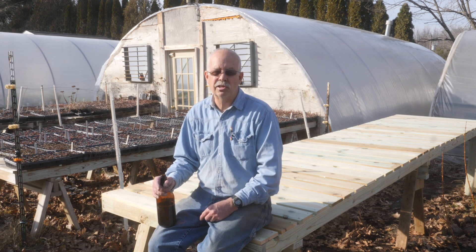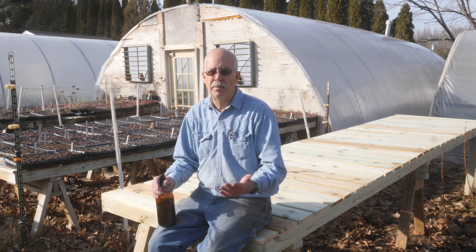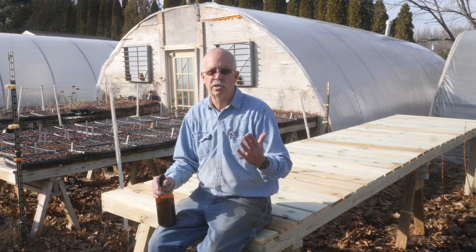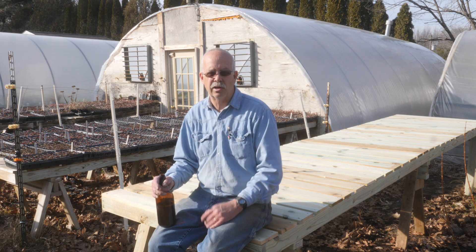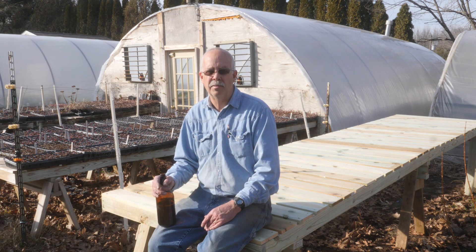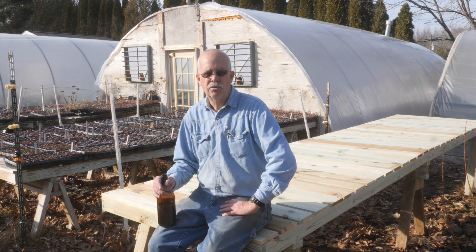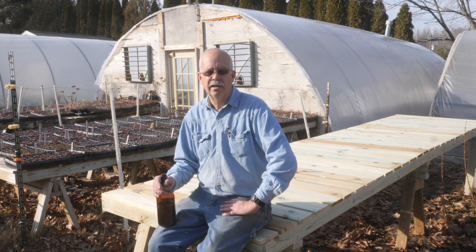There are a lot of shortcut ways to do this. Some people don't cut the bevels on the legs — I do. On my sawhorses I use in the shop, I actually chamfer down where the legs pass through the bottom part of the I-beam. On these utility horses out here for the benches, I don't do that. So when you look at Next Level Carpentry's video, he goes into great detail on it and he is quite the master carpenter.